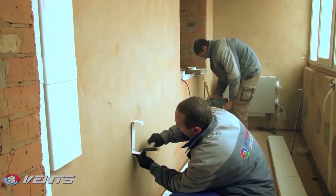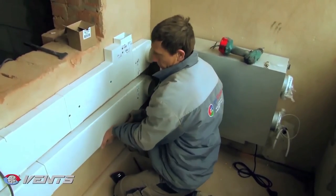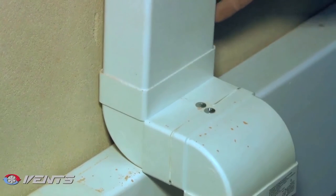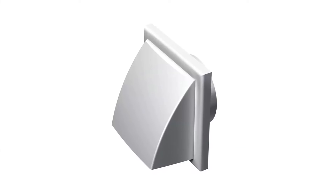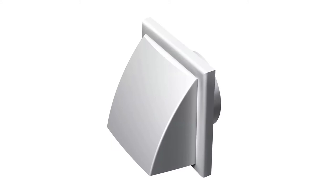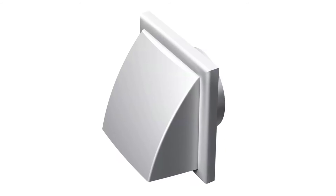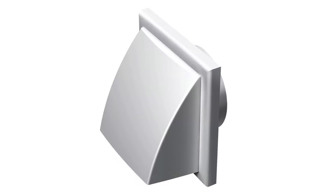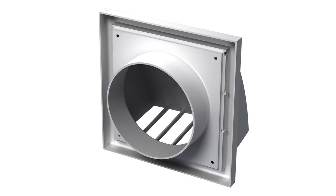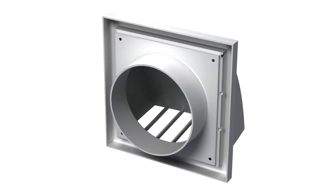The proposed air handling unit is also equipped with two electronically commutated EC motors with maximum power consumption of 125 watts. The MV 122 V external grills, hoods, are used as terminal devices for air supply and exhaust. It is important to ensure that the upper hood is used for air supply, whereas the lower one is used for air extraction in order to eliminate the possibility of reverse exhaust air transfer to the serviced space.